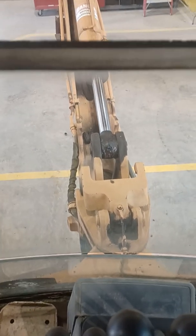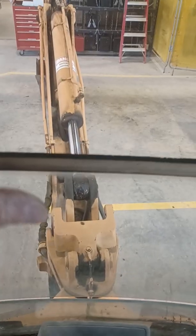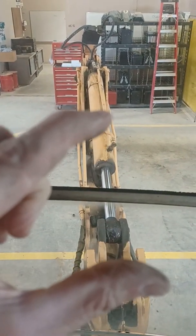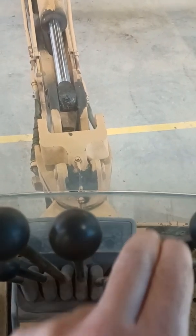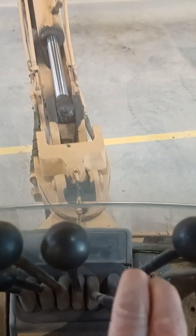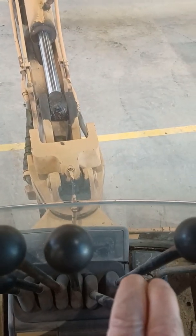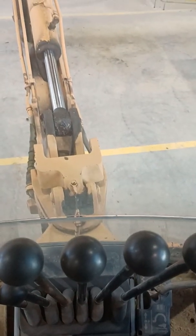What's a little tricky about this is it's got an over-center design. That cylinder is going to get shorter to raise the backhoe boom up, but once we get it to go over center, we need the cylinder to get longer again to bring the over-center linkage into the latch position. You've got to have a little bit of courage here because we're going to be fighting instinct — we'll use this boom raise lever, raise the boom up, and then just as it goes over center, go down quickly to latch it into the transport position.